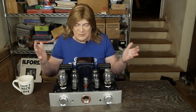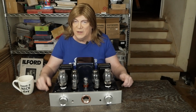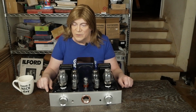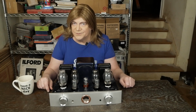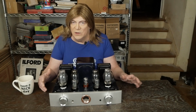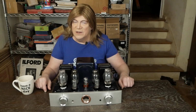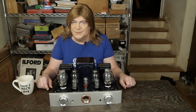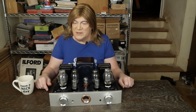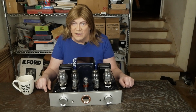I guess the bottom line at this point, if you do this transformer upgrade and you fix the power supply, as long as you need under 4 watts of power, leaving a little bit for headroom, this amp's probably okay. But so is an EL34 amp. A Rysong A12 will do what this does, and with Skokie mods, it's a $500 amp. And it uses under $20 tubes. That's the problem with a 300B amp, is good tubes are going to be $700 or $800 for a pair.